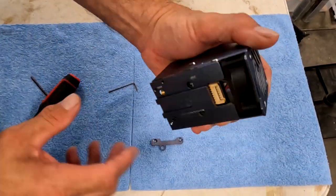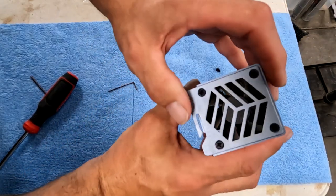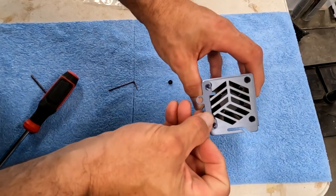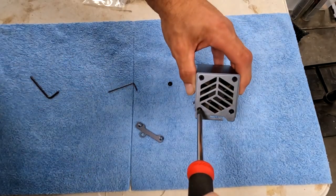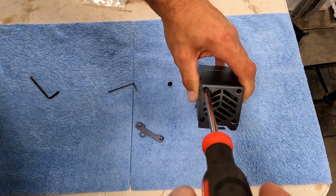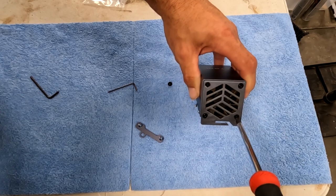The next thing we want to do is put the little tube holder for the air assist on here. If you look on the back where the wiring harness goes and turn it the way I've got it in the picture — the directions show you too, but the hole goes down that direction. That's for the hose to go through, which is going to go to the air assist nozzle at the laser. You just have to take these two screws out on the left-hand side, put that in, and tighten it back down.